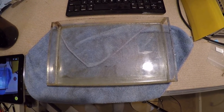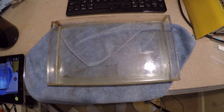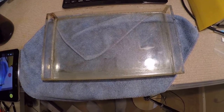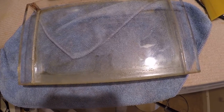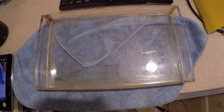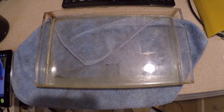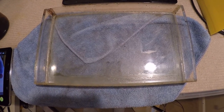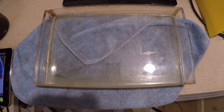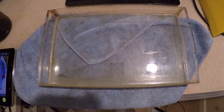I had a print failure where I printed overnight, the part fell off the build plate, and then repeatedly cured on the surface of the vat for a couple hundred layers. When that happens, some resins — and this seems to happen more with some resins than others — with Fun2Do I've never had this issue, but I was printing with MakerJuice, and I think the shrinkage has something to do with it. When you repeatedly cure resin on the same spot, that resin will shrink.